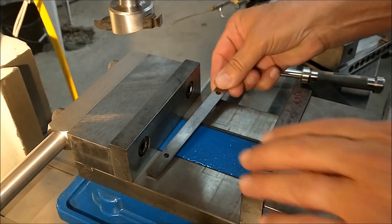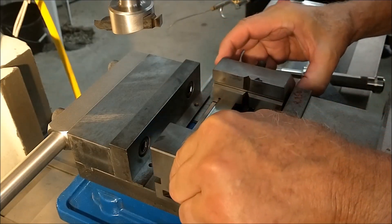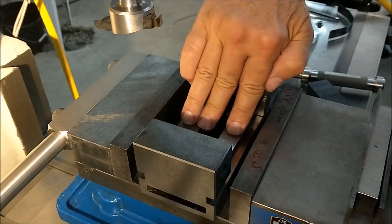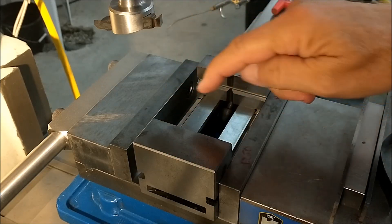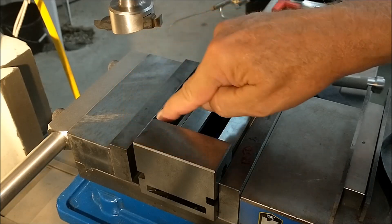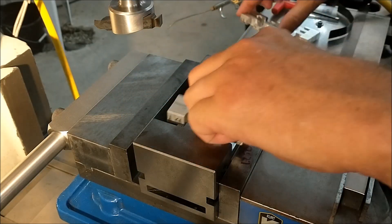I'm going to use a half inch parallel right there against the jaw. Put your vise in there, clamp down on the vise, close the table, close the vise. There you go. Now we know that the top of this vise — this is the top of the vise ultimately — is a half inch from this back surface. Load your parts.